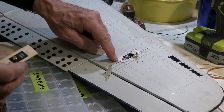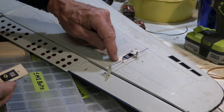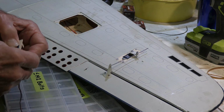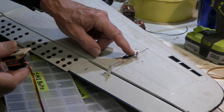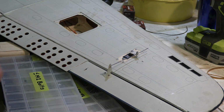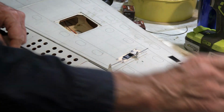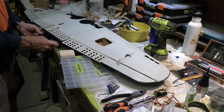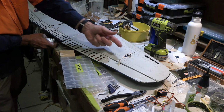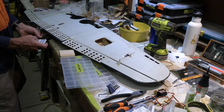We've then put 4 screws into the corners, and we've had a look where the other screw holes were, and we've picked that particular set of spots to miss the old holes. I've decided to have the arm longer, just so that there's less of an impact of this thing going up and down when it goes back and forth. We're using the little swivel sort of connector there for the control rod. I've routed the servo wire through here. We used a piece of string and dropped a nut down through to get a hold of it, and then we pulled the wire through, got it to this point, and then stuck it through the other side.